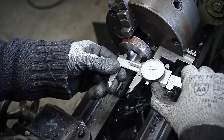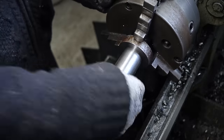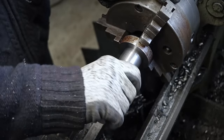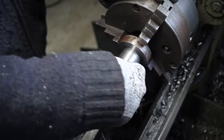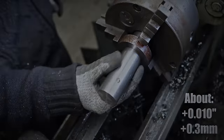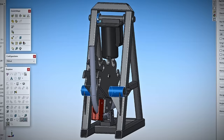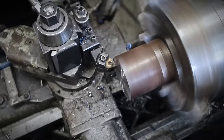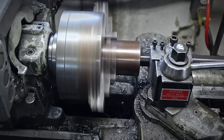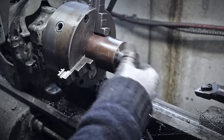These bushings will be used for the two main pivot points. One is for the die and the other is to hold the bottle jack. Nah, gonna give me a bit more room than that. That's too tight. Ah, perfect. I did machine three more bushings for the frame. There's one here, here, here, and here. But since it's the same old process of facing, drilling and boring, it is boring, so I'm gonna spare you with that part. All right, now I need to cut some tubing.